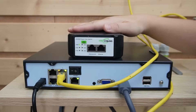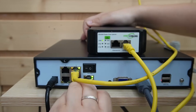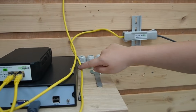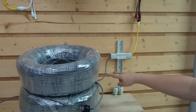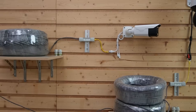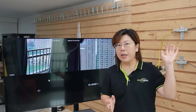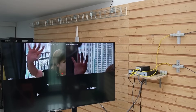To solve the problem, we're replacing the PoE NVR with a 90W PoE++ injector. First, connect the short patch cord from the NVR to display video footage. Then connect another short patch cord to the output port of the injector, sending 90W of PoE++ power and data to the first extender, through the 400-meter Ethernet cable, to the second extender, and out to the PTZ camera. Once we swapped in the injector, the PTZ camera powered up and started working perfectly — I'm waving my hand so you can see the live video feed.